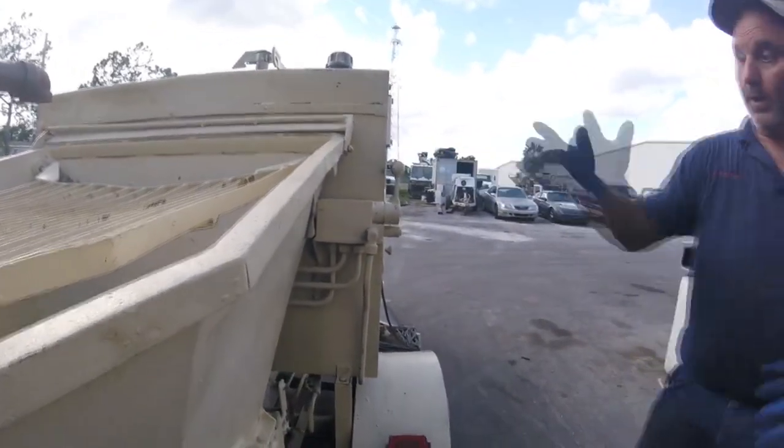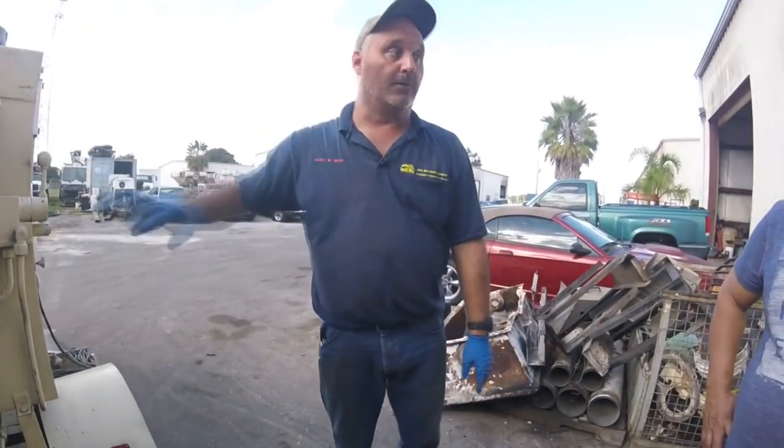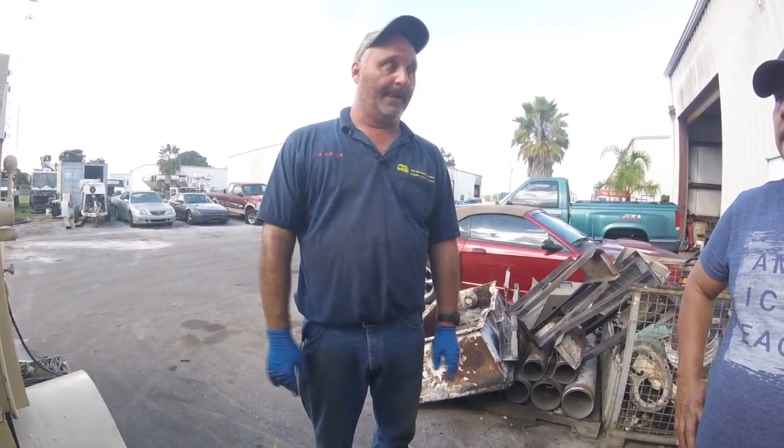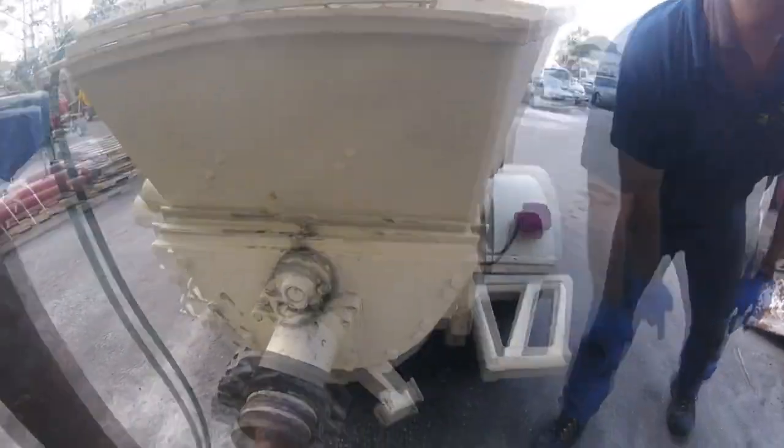This thing runs, the whole thing runs at about 200 bar. So when you lift that grate up, make sure it's in neutral or the engine's off, because it will pull you in. It will. And it ain't gonna stop. It'll pull you right in until it rips something off. I guarantee you that. Just like sticking your hand here in the rock valve.